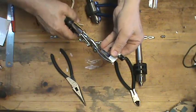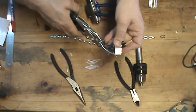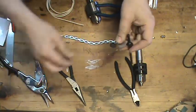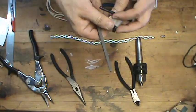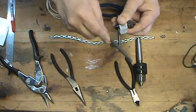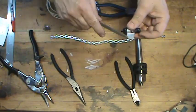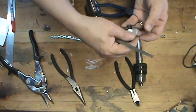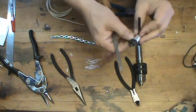This only needs to be big enough to put a screw through it. Always clip off the corners so you don't leave any sharp corners. It's also good to have a file, and you can run that file over the edges to knock off any burrs.